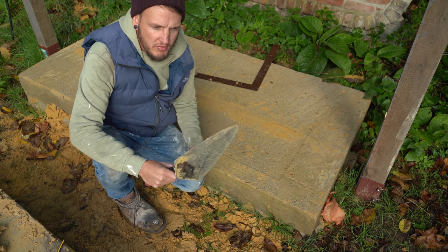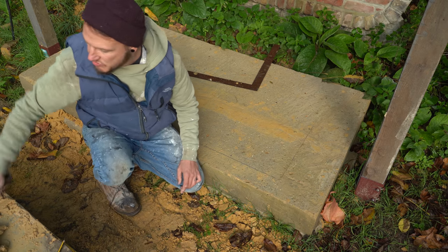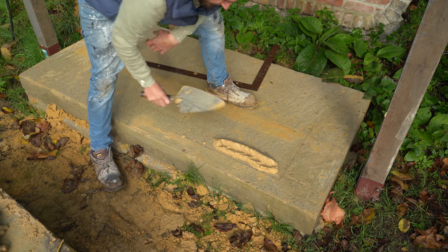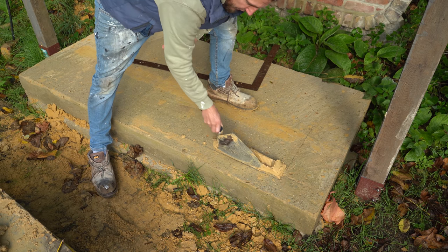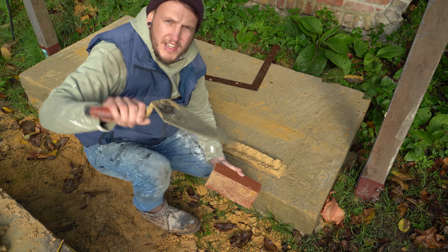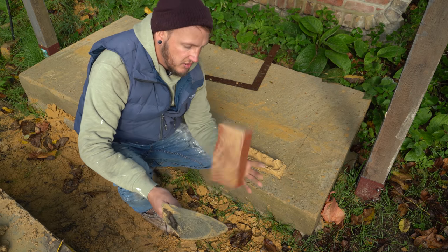Rolling the muck as I showed last episode - it's practice to get your hand used to the trowel. Do it as long as you can, but once you get to a certain point the rolling takes up too much time. I'll show you a quicker way in the next episode when it comes to running in. For now just roll your muck out, get a bit on your trowel, and as I showed before - tap, tap, tap. Get it right, a little bit more on that corner there. You want to keep it off that line so you can see it.